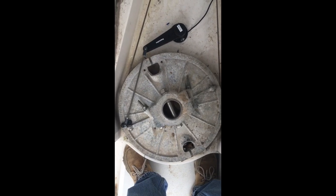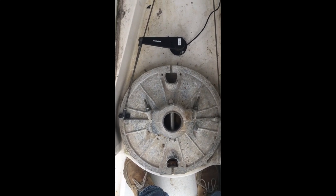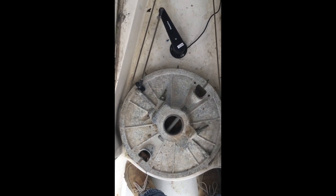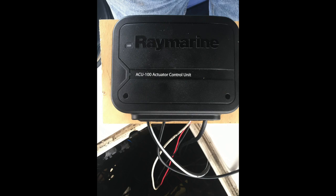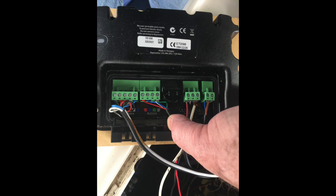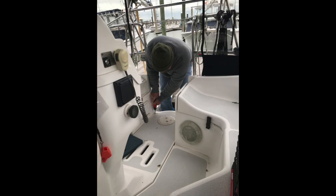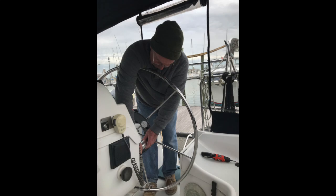After I connected both ends of the connecting rod, I tested to make sure there was no interference by turning the steering wheel. The final step of the hardware installation is to attach the transducer wires to the actuator control unit in the appropriate place. Finally, I put the deck back down, the steering wheel back on, and went through the configuration of the autopilot so that the rudder reference transducer is recognized by the system.